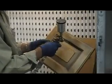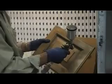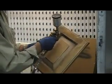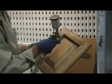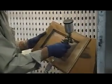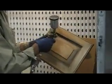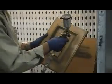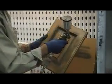You pull the trigger along, spray it right into those little door profiles, gets the look that you're looking for here. Moving in a little bit closer, you get a finer line, you can pour it on a little heavier. Back off a little bit, it gives you a more atomized pattern across the door. Great for getting into these little areas of the profiles.